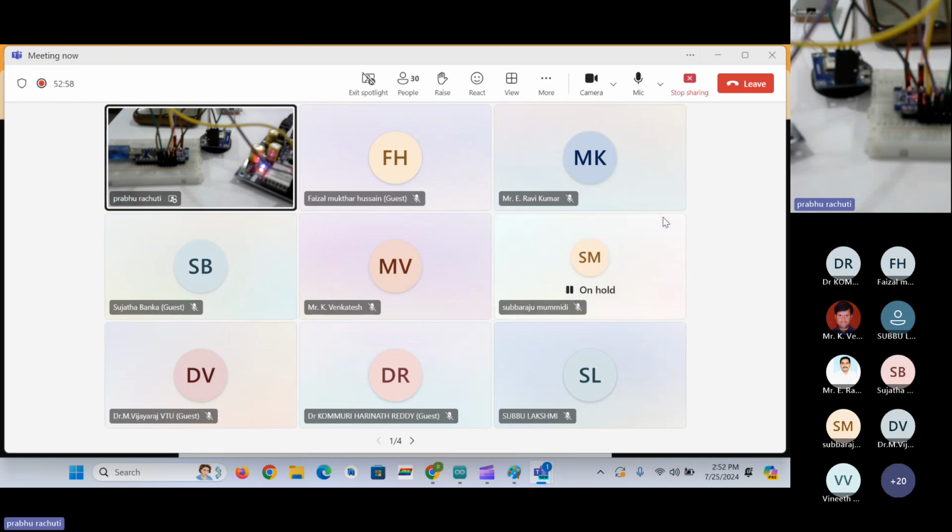If you just add a keypad to this Arduino module, you can make calls as well. You can enter the number and customize it. Previously, the number was given by the user in the coding part. So if you want to customize the number, you can enter it through the keypad, and you can make calls and send messages through the Arduino device. One keypad is enough to make it a keypad phone that will make calls, send messages, receive text messages, and respond.